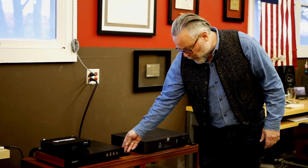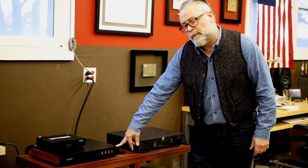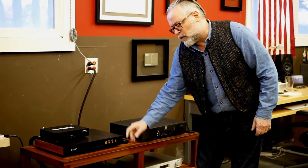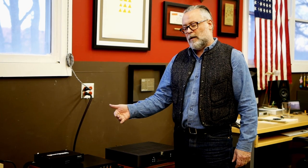While we're up here, this is the Spring DAC from Holo Audio. The Spring DAC is a discrete resistor ladder DAC, and there are actually two separate resistor ladder DACs inside — one for PCM and one for DSD. Another interesting feature is an oversampling option: there's an AKM oversampling chip inside that allows you to up-convert, either keeping everything as PCM, upsampling everything to PCM, or upsampling everything to DSD. Reading around the internet, it seems like the non-oversampling NOS mode is the most popular.